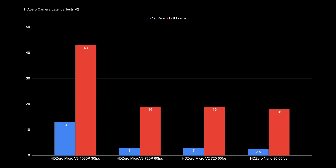There is a clear difference between the 720p 60 modes and the 1080p 30 with latency. The frame time increases to about 33-34 milliseconds compared to 16 milliseconds at 60 frames per second, and there is some additional first pixel latency due to the sensor reading out slower and the refresh timing relative to the goggles display. I don't think these numbers are terrible. In my flights, yes you can feel the latency in 30 frames per second, but this camera is going to be really good for wing use and long range use where people want better image quality over lower latency. I still firmly believe that 40 milliseconds isn't terrible for anyone who isn't racing.